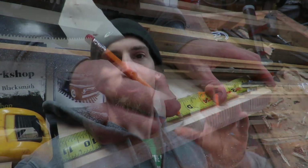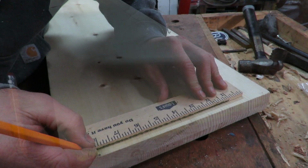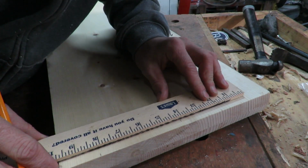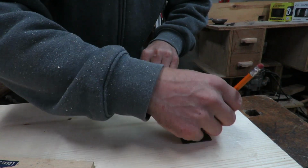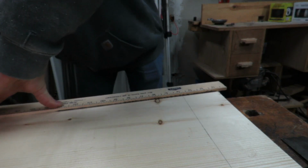And I'm working with 12-inch wide boards, so that should give me a pretty solid base without having to make a big square. So I'm trying to go with something where, as it's going up, everything's kind of tilted in towards the bench grinder. My top, I'm going to end up centering it up, and I want the top to be 8 inches wide. So I'll end up cutting 2 inches off of both sides and just get a nice taper going up towards the top.